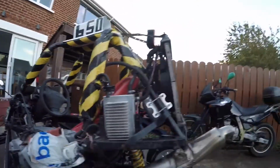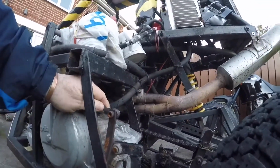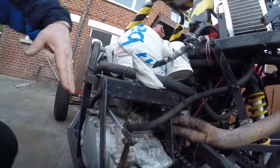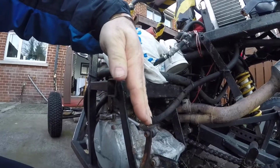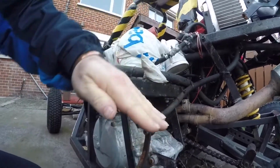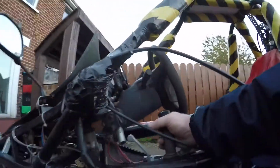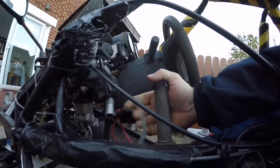The tricky thing to do is the gear change. Obviously in a bike, your lever just runs along here, so you actually put it up, and there are all wee linkages here, so it runs up. It's very hard to see and explain, but it runs up to a pivot point and over, a bit like the paddles of a bike or a seesaw, so it's pivoting. Say where my knuckle is, and it's actually pivoting around that. It transfers it over here. The beauty of that pivot is what changes the drive. So I go forward, I get first gear, and second, third, fourth, fifth, and that's my clutch.